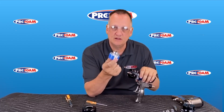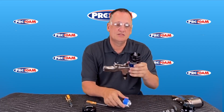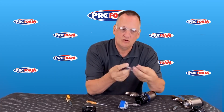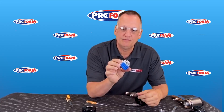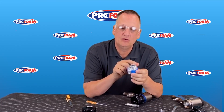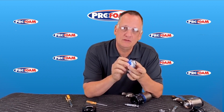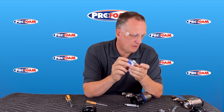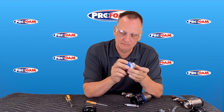Here is the assembly that holds our side seals, and here's our mix chamber too. There is no hole here that you have to clean — that's inside this unit. All these little components are inside here. They've also added check valves in here for each chemical and one for the air, which it didn't have before. That's to help keep crossovers and contamination from going backwards in the system and making you spend more time cleaning your gun out. So that's all contained within this disposable unit.